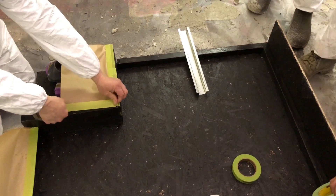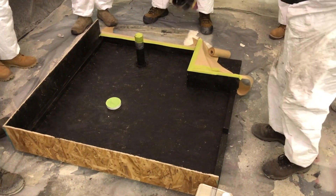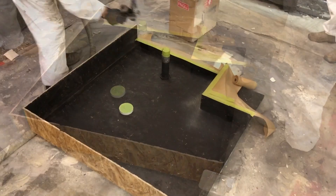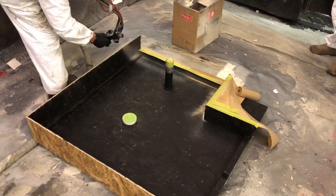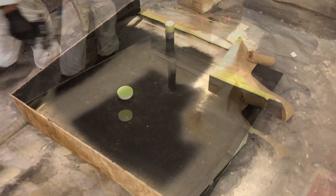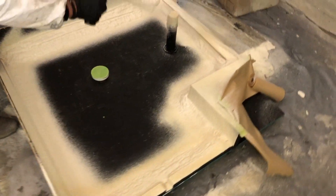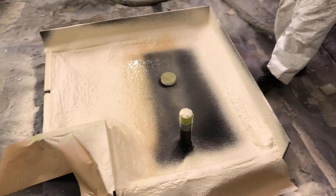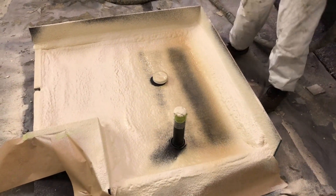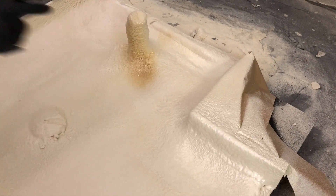Make sure to properly mask off areas that you don't want oversprayed. For the cleanest lines use wire tape. Next we apply our Roof Armor heat shield three pound roofing foam. The heat shield has been specially formulated to have an even rise to help the foam spray flat. As you can see here, we start by building up the edges and go from there. Putting 45 degree angles on the edges and around the venting acts as a stress release once the coating is applied.